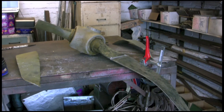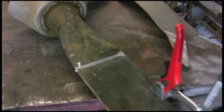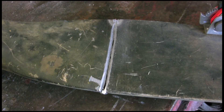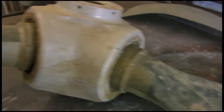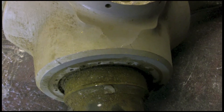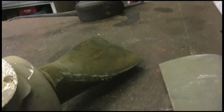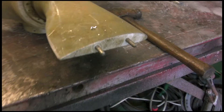What I've started doing is pinning it with some short dowels. I'll tack this one already at each end and veed it out. Hopefully my welder will weld it up because it's pretty tough aluminium - it's hard, fancy stuff. It rings almost like steel. I don't know what it came off but it's been sitting in a barn for ages. So I'm going to give it a go with my spool gun and just some ordinary aluminium wire and see what happens.